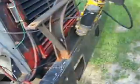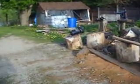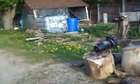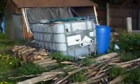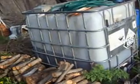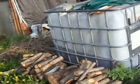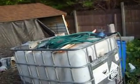And now, I told you I run it on used vegetable oil. I keep my used vegetable oil down here in the tank over here. A lot of people say you got to have heaters on it, and you got to run it through three or four different strainer systems. Now, I don't run it straight by no means, but I filter it through a nylon sock first, and then I leave it set in another tank, and I got the same pump that I use. That's that blue thing up there. That's the pump. And I've got a fuel filter that goes on that.